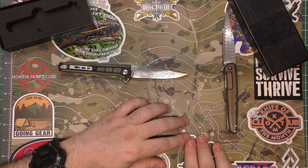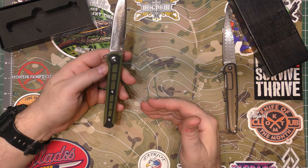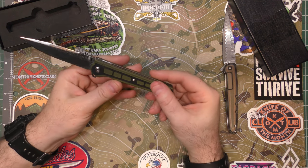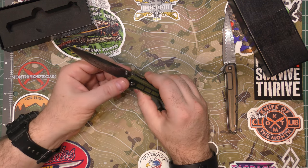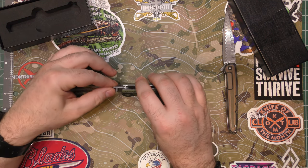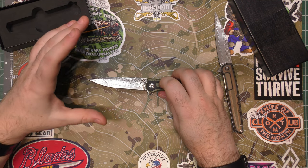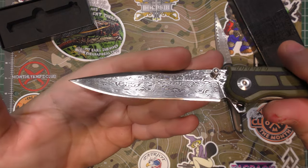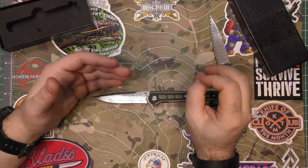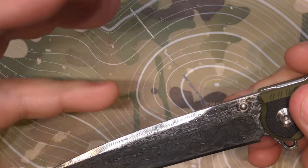But I'm going to take a step back here, and for those of you who are unfamiliar, let's explain what the Damascus process is, or what is properly called today pattern layered steel or pattern welded steel. Because the honest truth is, when we talk about Damascus steel, we're really talking about Wootz steel, which is not made anymore. We've lost the secret for how the original Wootz steel was made in the East centuries ago. We don't actually know how they did that. So we give the name Damascus, yes, from the city in what is now Syria, to this pattern layered welded steel, which takes two dissimilar steels. You can do it with one steel, but it doesn't come out the same. What they do is take a steel, primarily one with more of a stainless composition and one more of a carbon composition, and they layer them, A, B, A, B, A, B.